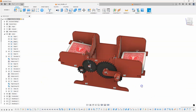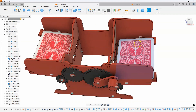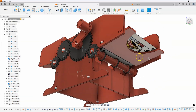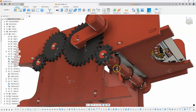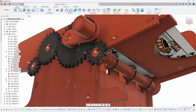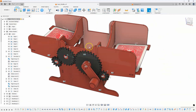In this example I have the gears already meshed correctly, and I created a slider joint between the card and this angled 3D printed piece right here. I did the same thing on the other side. Right now there's no linkages at all. If I look underneath, I added a couple little white notches so you can visually see what's happening as we rotate this shaft — those little rubber grommets are going to grab the card and pull it through into the middle area.